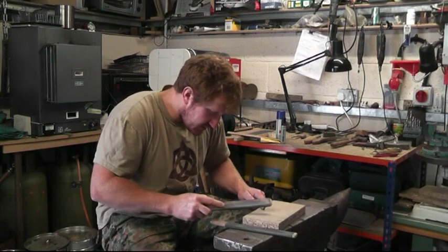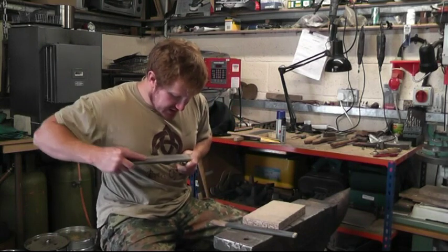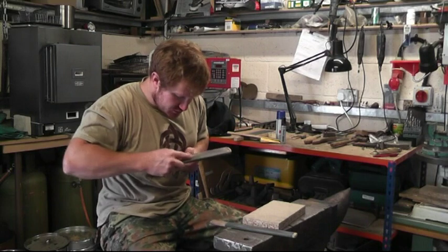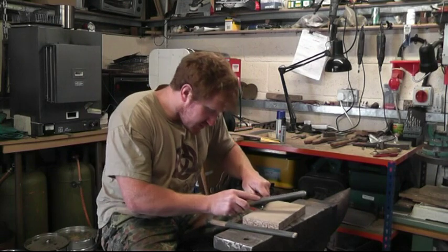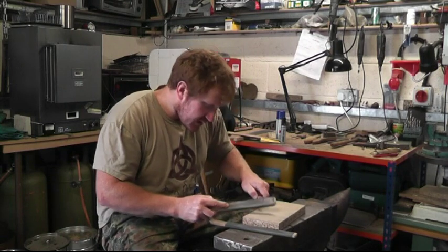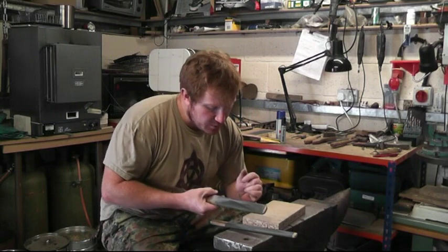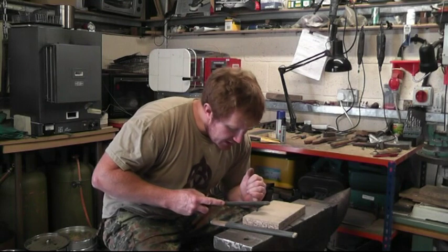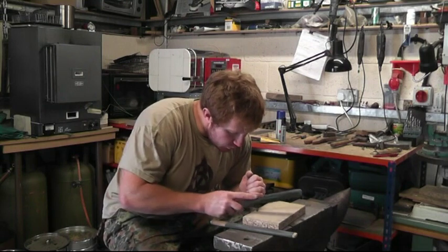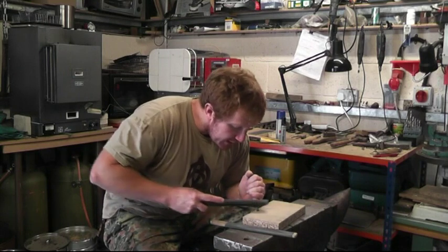So we'll work around that curve, again take that different grasp to the body so that you can get to that nice hook nose of the tool, all the way around. Just touch that a little bit more there. And then what we can do is we can flip it and we can do the inside part of our curve now with the radius edge of the strop, again ensuring that we only push away from the cutting edge and making sure that you lift it away from the tool before drawing back.